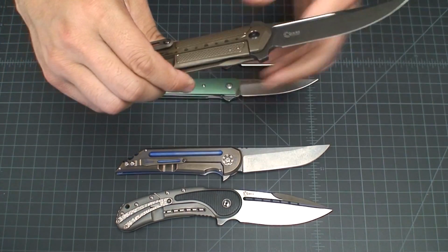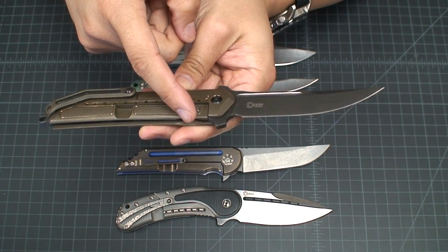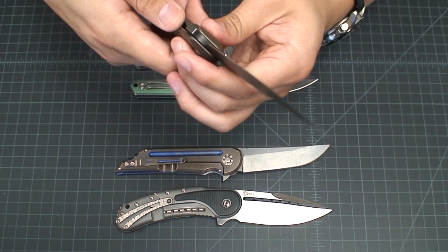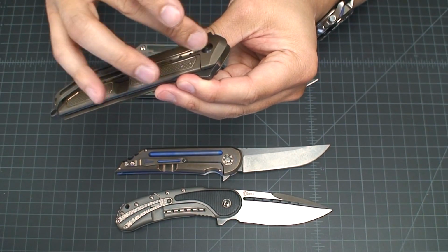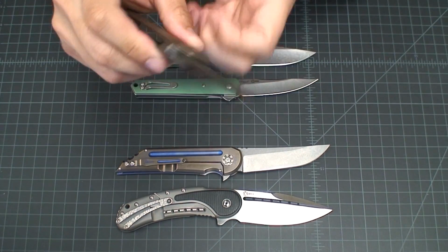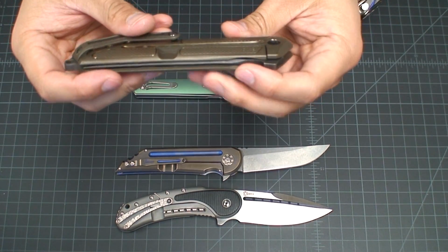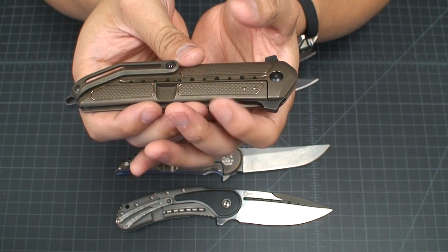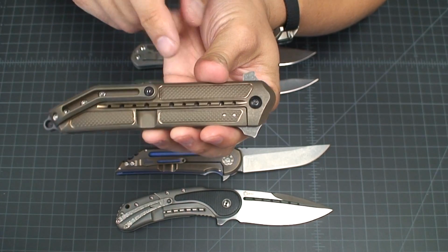For mine, personally, I just anodized it. I stuck it with the full black wash. I was actually just wanting to anodize these little polished milled parts here. And what ended up happening is, when I stuck it in the anodization bath, whatever the finish was on this, I think it's a DLC. Is it a DLC or is it a titanium? I think it's a titanium nitride finish. And so it's a pretty hard coat finish, and what it ended up doing is kind of burned off, and so it was really slow at anodizing. I was trying to get it to be blue.